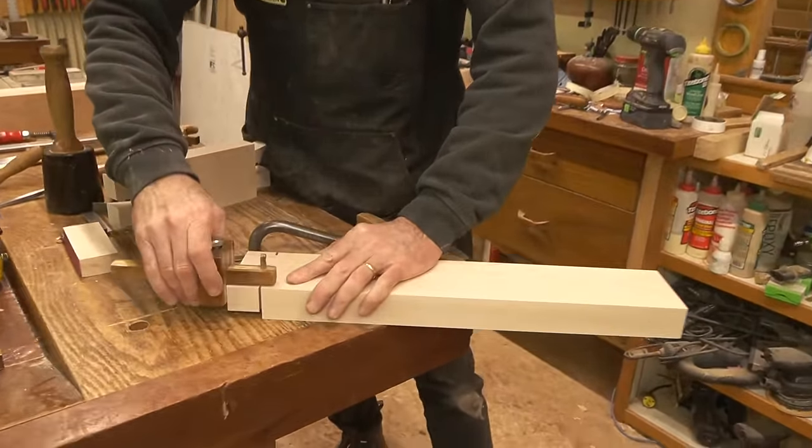I'm just going to lightly go straight down and take that off. Now before I move I'm going to go ahead and chop this. I can use the mallet and come in this way. See how I use that shoulder as a beautiful guide — then I get a nice crisp clean inside cut. I'll flip it over and do the same thing on the other side.